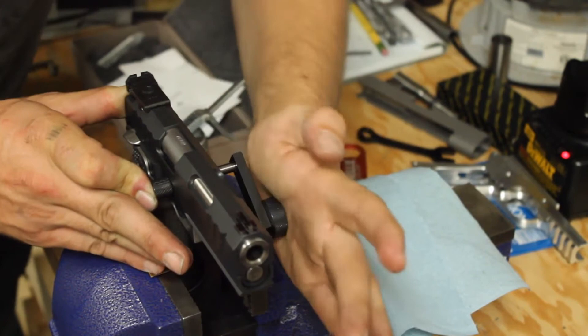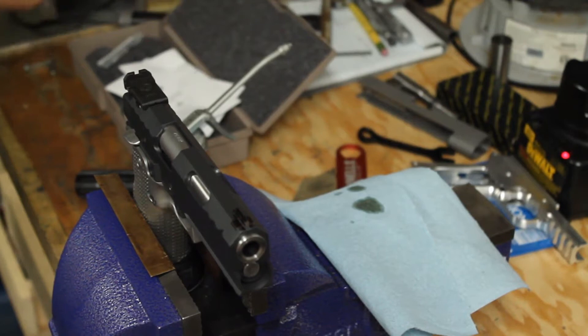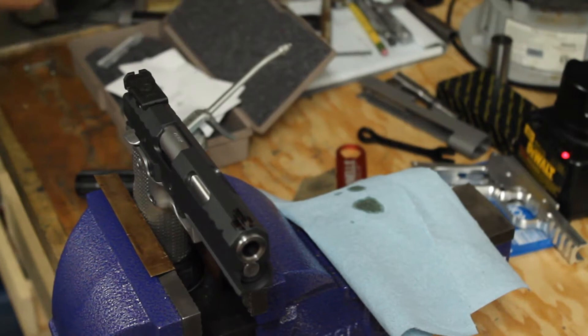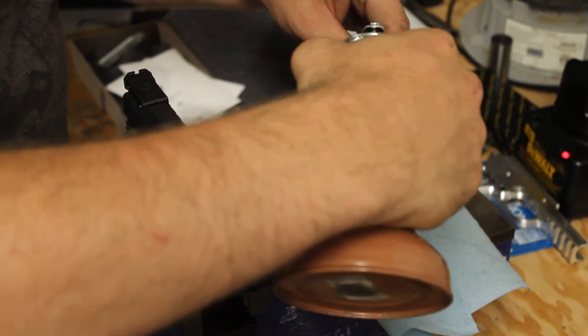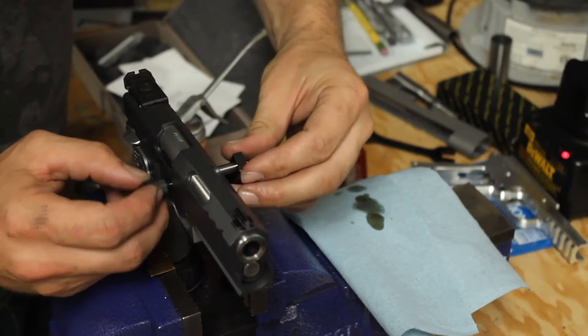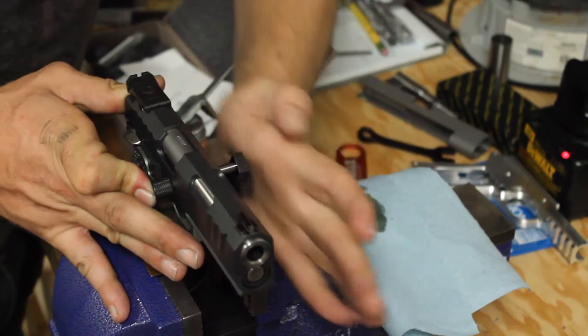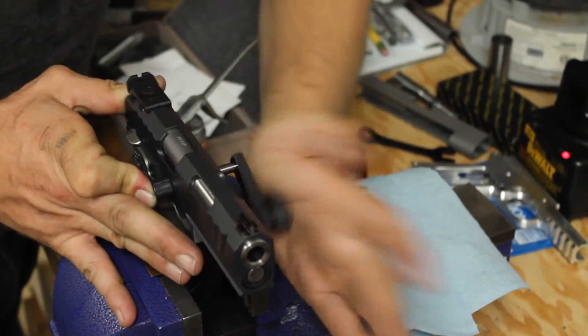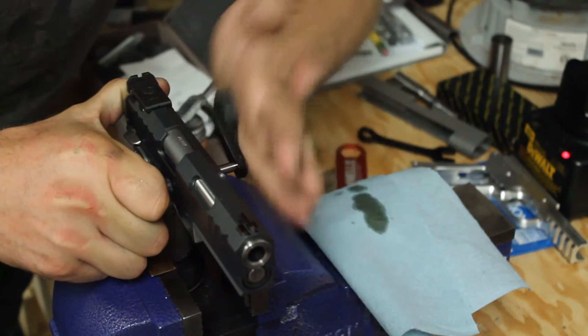We've slowed down on how much we're cutting, so it's not cutting as fast anymore. I'm going to back the barrel all the way back and pull out the cutter to clean it off. You can use a brush — I like to use air. Clean all the chips out that could have been clogging it up and causing it not to cut as well. Reinserting and going again — now we're moving. You can put quite a bit of pressure on the back of the slide, you don't have to baby it. I'm watching the thumb safety and the notch in the slide to watch them come into alignment.